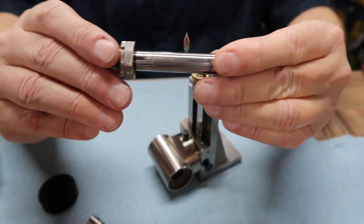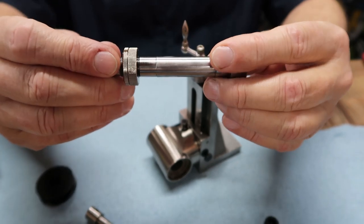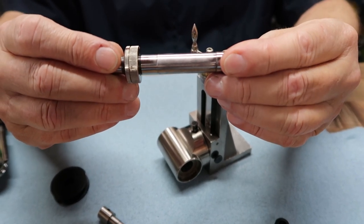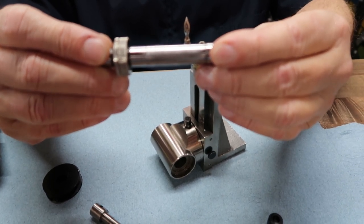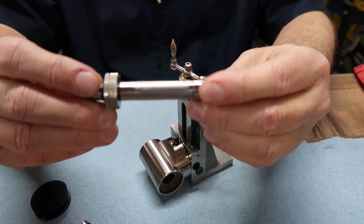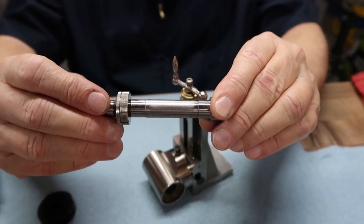In this case, though, somebody got tricky. We got a smaller diameter and a bigger diameter. We don't understand why. The bigger diameter is up front and the smaller one is in the rear, but we've never seen that in a two-bearing, angular contact arrangement. So it really baffles us.